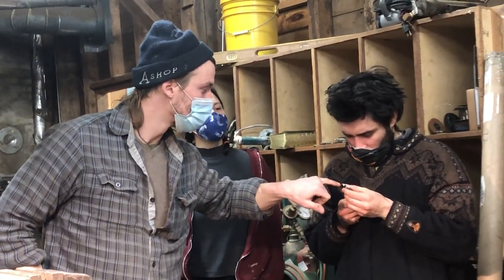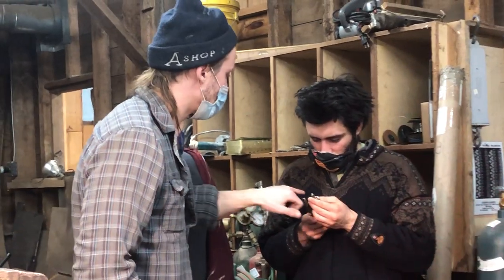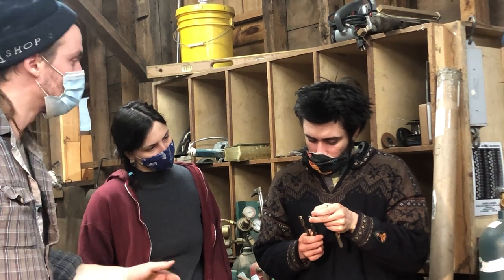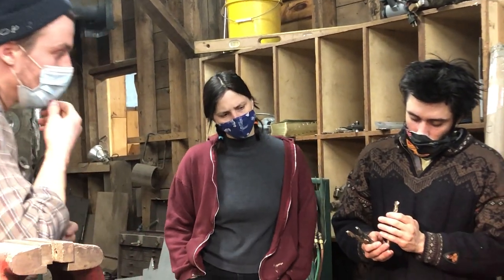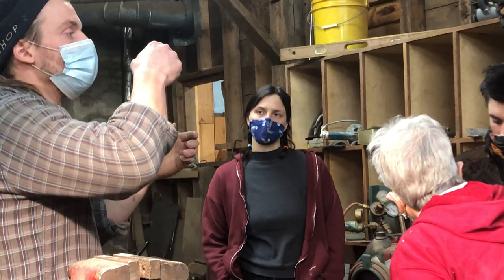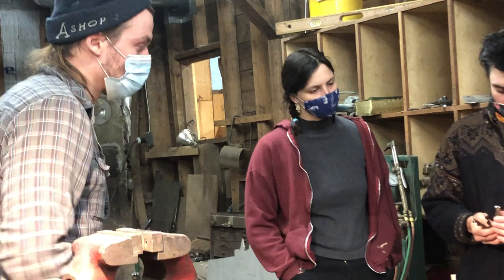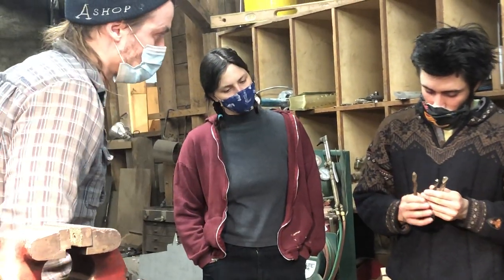This black one here, if you look at that, you can see where the temper has been taken out of it, and the next thing that will happen after you've removed the temper is you will wind up taking chunks out of the cutting edge, like the one that's in Jonathan's left hand. That's what you'll get more so if you're cutting metals and you're not clearing the burr. Or you come down and there's an already existing burr in a hole, and you're winding that bit at a higher speed, and all of a sudden it catches that burr, and it's just going to blow a chip right off that cutting edge. That's the one with the big chunks out of it. And then to a much lower grade, this is like hitting a fastener in a piece of wood, catching the corner on it or something like that.